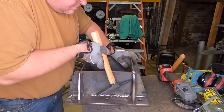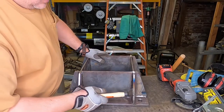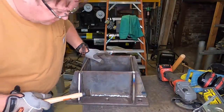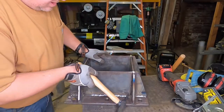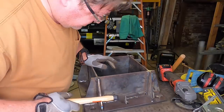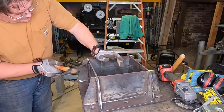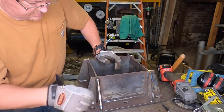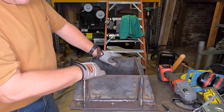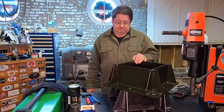Got a little undercut in here. The base plate here is three-eighths of an inch and the side plate's a quarter of an inch. When I was welding down on this base plate, getting into this angle here, you could really hammer along with it. But when you came up the side, it won't take quite as much heat, so you had to move along a little faster there, and in a few spots I didn't and got a little bit undercut — but nothing major. Now we're going to continue to clean this up a little bit, get a little Ospho on it, and then put some paint to it. Two post bases, ready to be put to use.